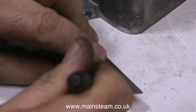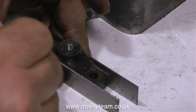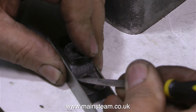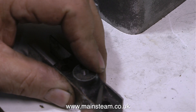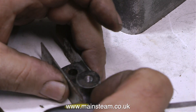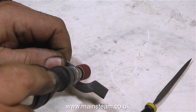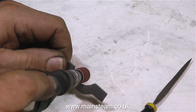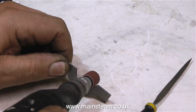This job starts by marking out the sheet metal — just holding it against the top cap and scribing it with a needle file. After marking out, I cut the pieces to size on the bandsaw, then finish them off using the 1-inch belt sander, followed by a small drum sander. The semi-circular cut-out I'm currently working on with the drum sander was profiled using the 1-inch belt sander.